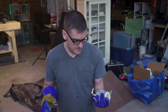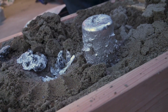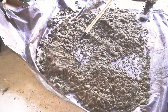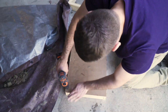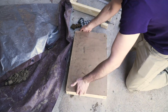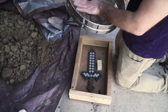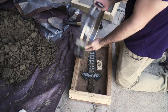Messed up a few things, and from that we'll learn and hopefully do a better job casting next time. For the second attempt, I forgot to cover my sand so I need to add more moisture and mull it all over again. This time I scaled down my box to a much more manageable size and cut some boards to screw into the bottom to help hold the sand in place as I flip it. I also picked up a sifter — you want just the finest sand on the edge of the mold for the best detail and smoothest edges — though the sifter I bought was apparently too fine-grained and mostly just got gunked up.